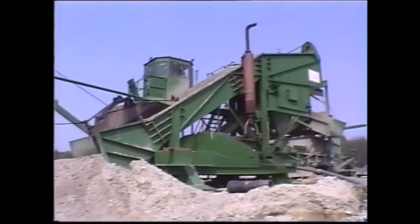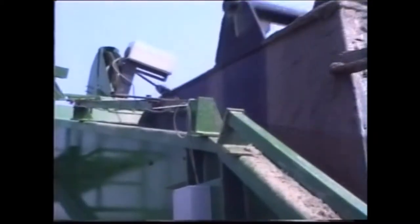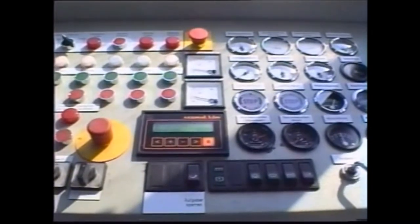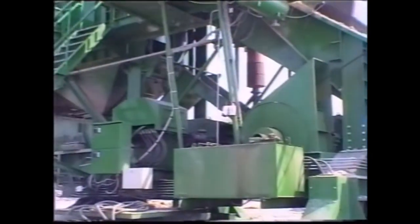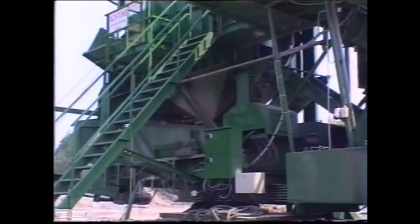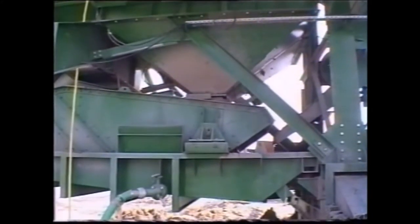Control of the bucket in the dead-end position is effected by two ultrasonic sensors. The additional emergency cutout switch is integrated into the cable drum's clutch mechanism. The display shows the current position of the bucket. The scraping tracks and speeds input via the keypad can also be read off. The automation controls the operation of the following stations: twin drum scraper winch, hopper, grizzly, feeder, dewatering screen, etc.